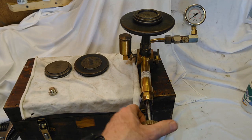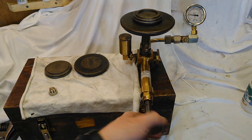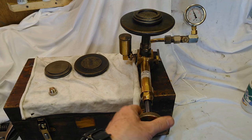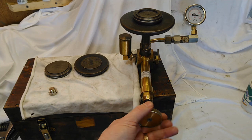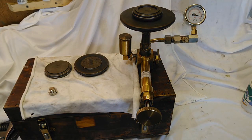Like I say, this will work up to 300 psi. I think the highest we go up to is the maximum on the oil pressure gauges on the Lancaster, 120, I think. We're looking there for an accuracy round about the 90 psi mark. So there we go. It's okay. We just spin that; it'll come down then. So once again, about 2 psi over. So yeah, Deadweight Tester. Easy peasy, isn't it? Lovely piece of kit. I mean, look at the design of it. It's just so simple. The only thing is you tend to get lathered in oil when using it.